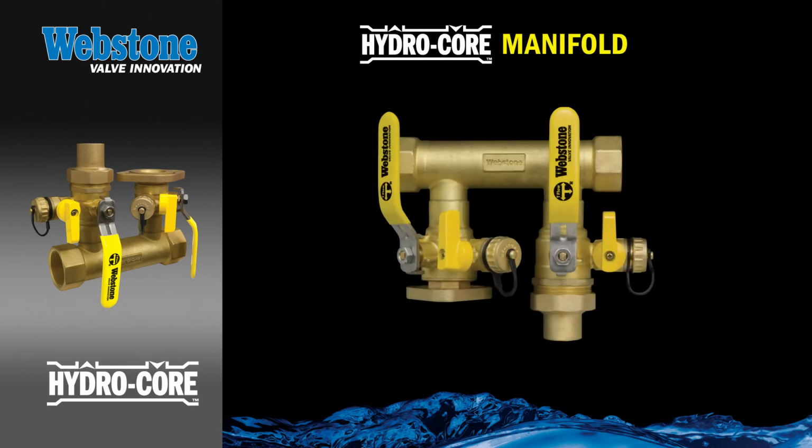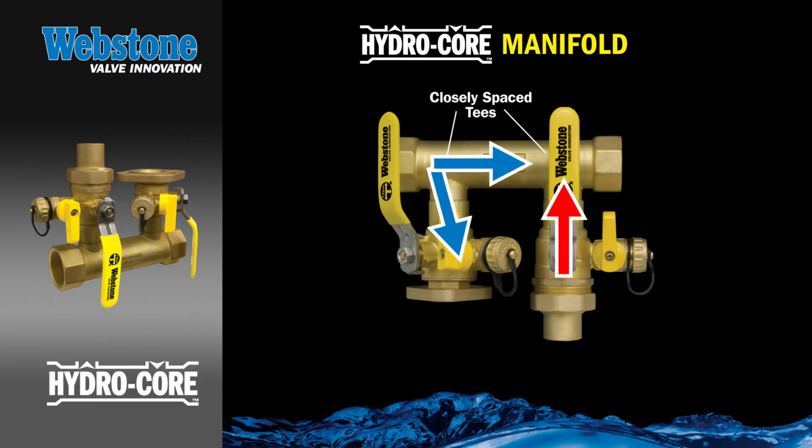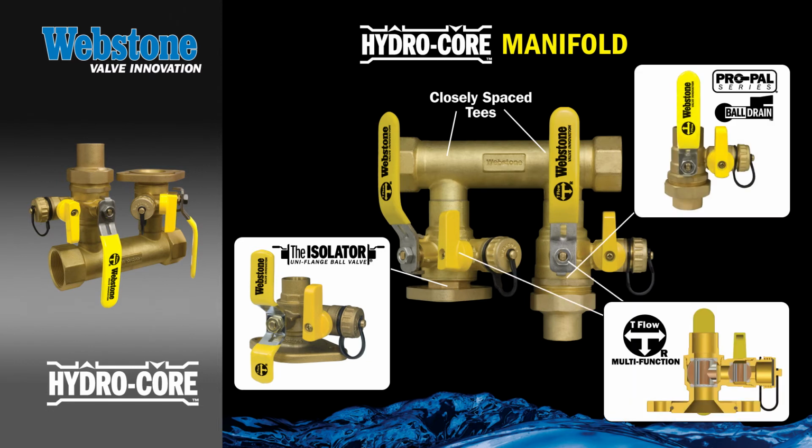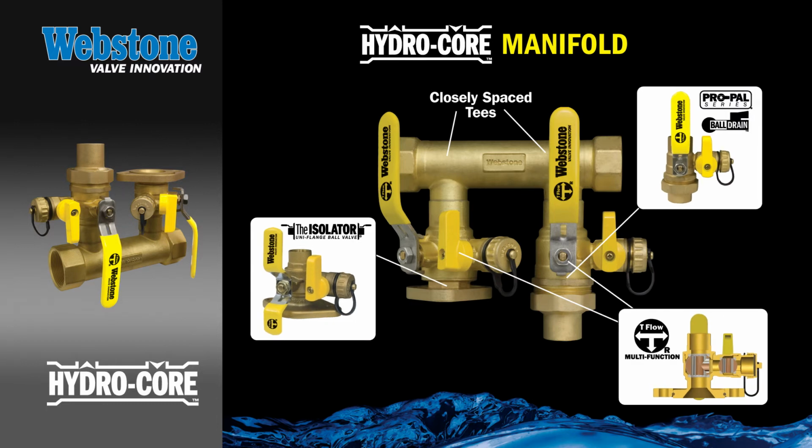The Webstone Hydrocore manifold boasts a sophisticated compact design that performs all of the functions just discussed in very little space. Each manifold consists of precision-crafted, closely spaced tees, bordered by an isolator valve with rotating flange and drain on one side, and a ball drain on the other. Both main valves are manufactured with Webstone's unique T-flow valve design, which allows flow to be directed into the drain from either side of the main ball valve. This unique valve design and purge drain capability makes the Hydrocore manifold extremely beneficial to the installer.